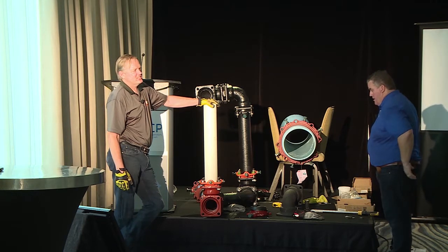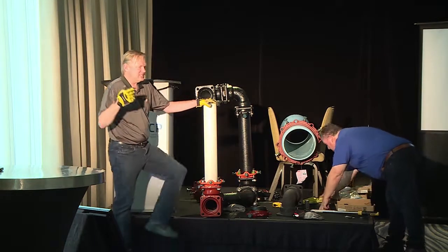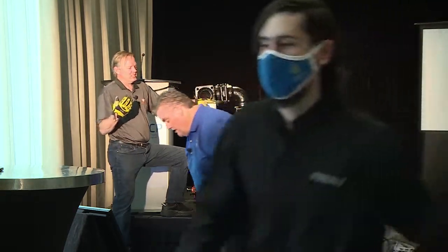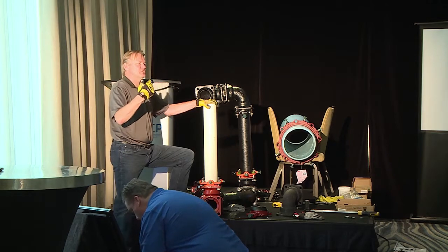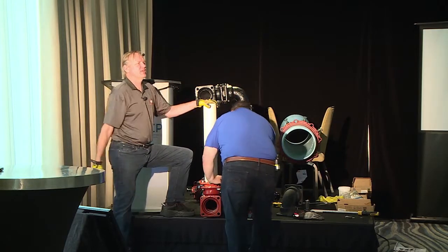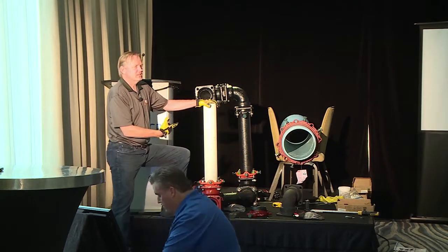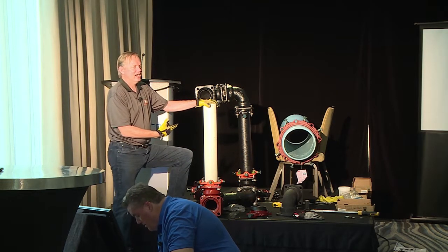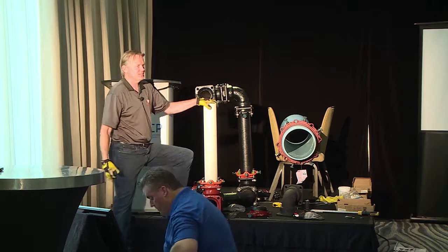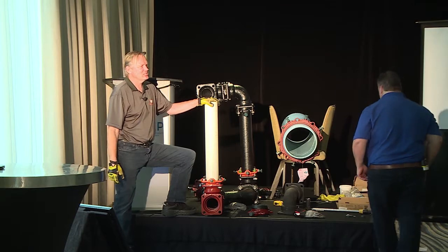What amount of deformation are you allowed on a C900? With the wedge, so what you're asking is how much can they jab into the pipe, basically? Yeah. The C900 standard allows for a 10% gouge, which would be the same as the amount the wedge is going in without adversely affecting the pipe. Now, these are not going to bite in 10%, unless you go a full reaction, some catastrophic event. 10% is a lot of wall depth, but you are allowed a 10% gouge in C900.